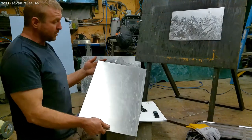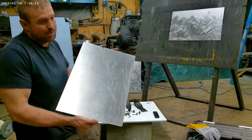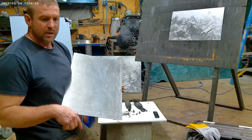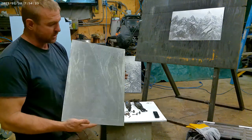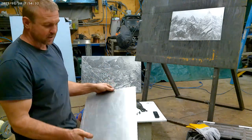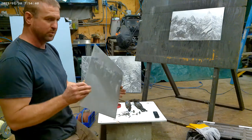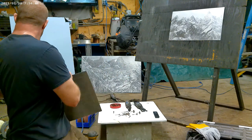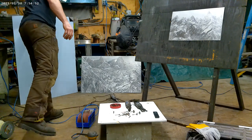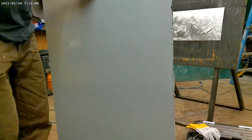This is your material — it's just aluminum sheets. You buy them in 4x8 or 4x4 sheets from your metal supply house — places that sell tubing, I-beams, and all that. What you want is a sheet of aluminum. I've tried several different thicknesses and gauges, and what I settled on was 3/32nds of an inch. A 16th of an inch is way too flimsy.